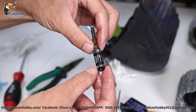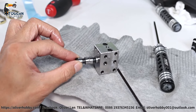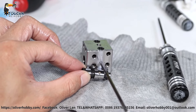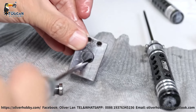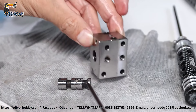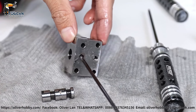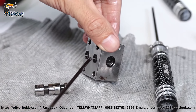That's the piston. Now you can see clearly. The piston should be inside at this position to align with the oil channel. That's the main oil supply inlet. That's the return line. So the inlet is in the middle — inside this block there is one oil channel. If I turn it around, you will see in the middle here there are three holes. The middle one connects from this side, connecting with the inlet channel going to the valve. On this side, there are also three holes. The middle connects to the return line on the left side. So this side middle is the inlet; this side middle has one hole for the return line.